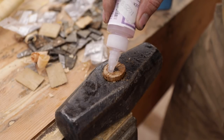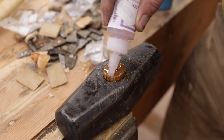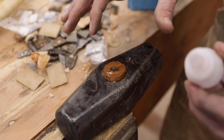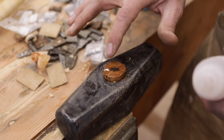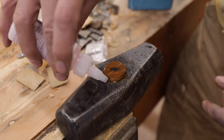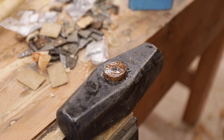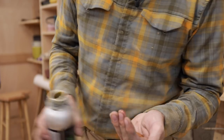I'll put a little Swell Lock on there. Wood absorbs moisture through its ends — if you look at wood under a microscope it looks like a bunch of little straws together, and it will just drink that down in there. This will swell that wood, swell the wedge. There's nothing wrong with putting a little bit around the perimeter as well.